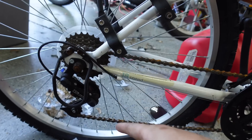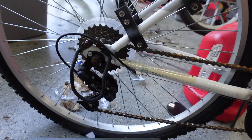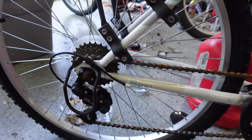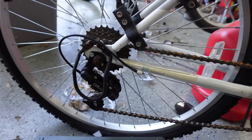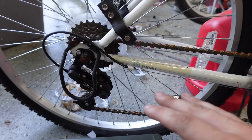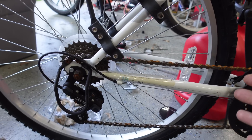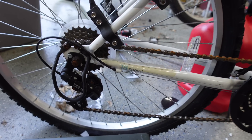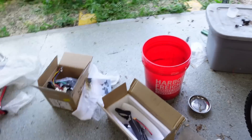Back here we have six speeds available to shift through with the rear derailleur, meaning we can have a very aggressive gear reduction for quick takeoffs and still have a large gear for high-speed cruising. The speed of a brushless electric motor is limited by voltage — voltage determines top speed and amperage determines torque. So we have a low-torque, not very high-speed mid-drive setup, meaning you can gear it for low end or high end but it can't do both.